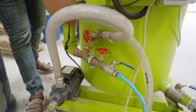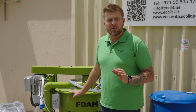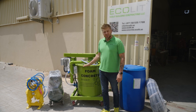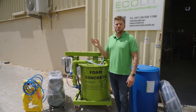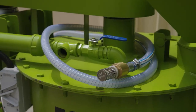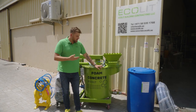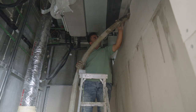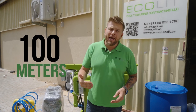The main difference and main features of this mixer is that you can operate in low density as 150 kg per cubic meter up to 1,400 kg per cubic meter. For that, we especially invented a switcher that can reduce RPM. You can operate with this machine from 50 RPM to 750 RPM in different applications. The productivity and capacity of this mixer, especially invented to cast floor screed or make wall infilling, or even blocks.